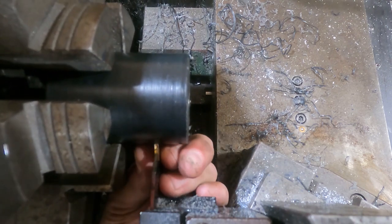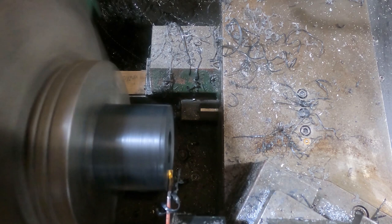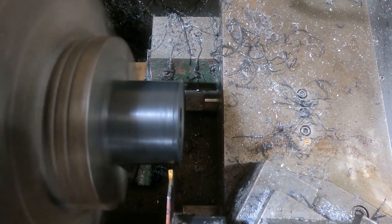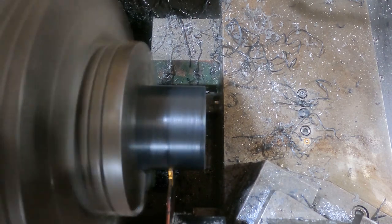We're back in the six-jaw with our plastic. We tighten up the cutter, clean that edge up, punch zero on the DRO, come over our distance, and the first thing we're going to do is cut a groove that our o-ring is going to sit in.